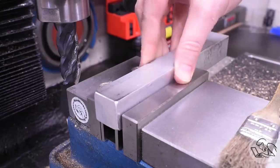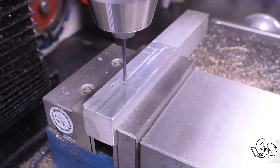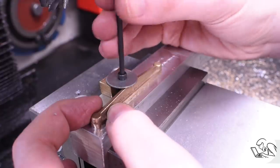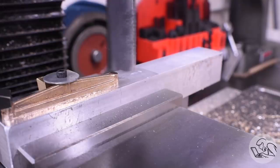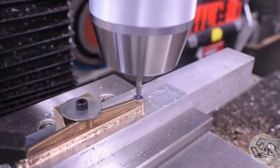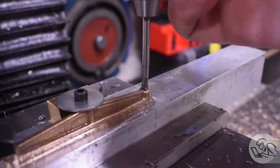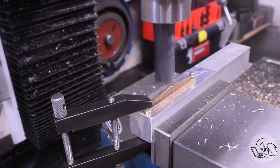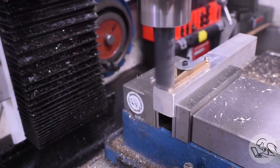Now we have a bunch of little holes to make in the top. I'm making a fixture block by putting a scrap of aluminum in the vise and machining it flat - I'm not going to touch it for the duration because it's been milled in situ so I know it's flat and square. I tap a hole in a random place, and now I can use one of those packing blocks, a washer and a cap head bolt, as a little strap clamp, with a toolmaker's clamp on the end. I machine the top of the first boss flat and eyeball the location of the hole with a caliper, drilling through tapping size then clearance-drilling the casting. Then I tap the fixture below, giving me a threaded hole I can use to bolt that end of the casting in place. I leapfrog my fixturing as I go, always keeping two things clamping the part.